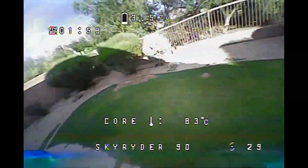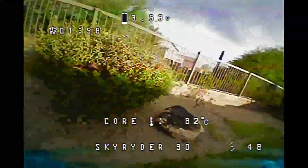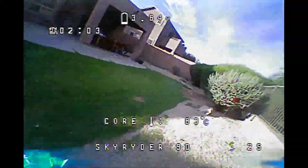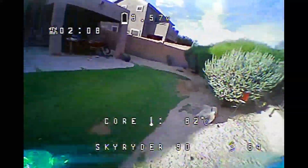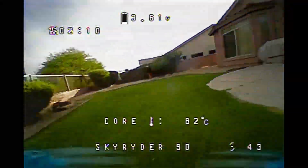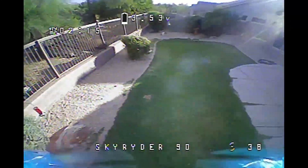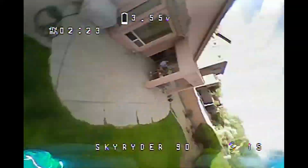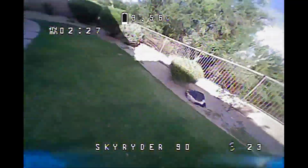People are reporting with the Newbie Drone — Patrick J. Clark was saying with the 1102 Flow motors he's getting three to four minutes on a 300mAh battery using the Nitro Nectar, which is pretty surprising. Especially since those are chunky motors, reportedly at about 3.48 grams — that's pretty heavy for an 1102. But he's getting pretty good flight time and people are liking them. So I'm kind of excited to try those out and go back to what used to be my favorite setup in terms of the 65mm prop.